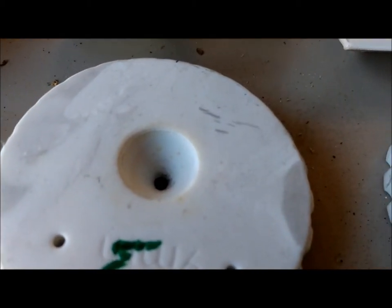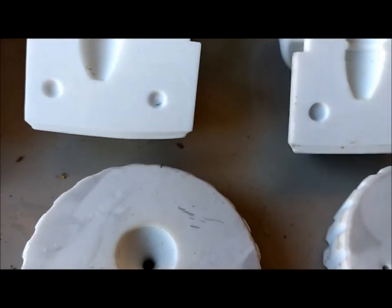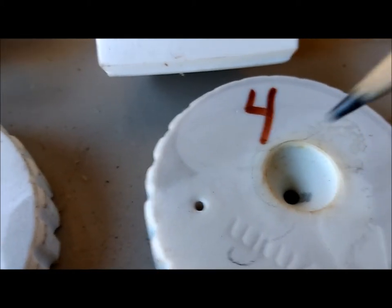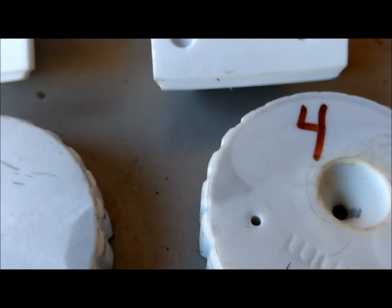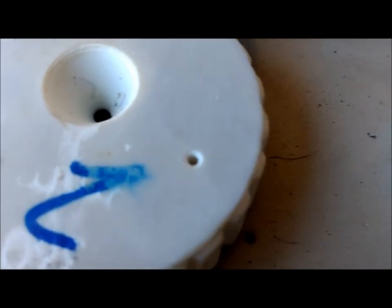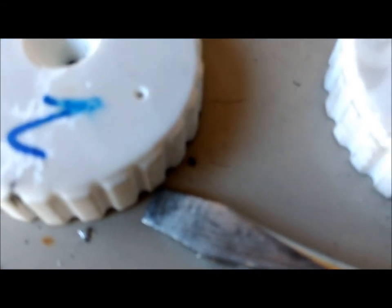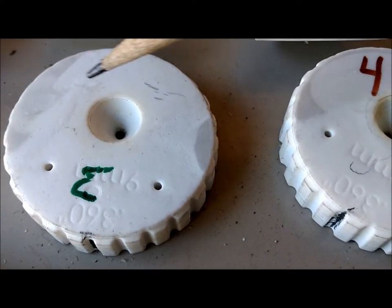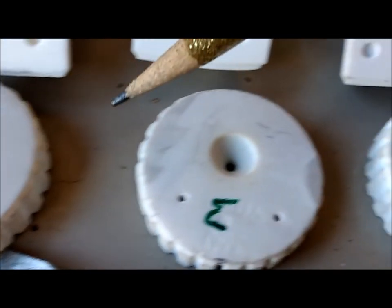Let me show you the lids. Can you see the slight browning around them? I got my pencil on the wrong damn one. One second. See the browning around the edges? That's because I'm letting it sit on there so long as I'm taking the bullets out of the mold — I'm not cleaning the sprue out quickly enough. This is number three, it's got the two scoops. I'm pointing it at this one here — notice the browning around the edge. That's to be expected, that's typical.